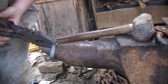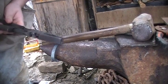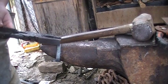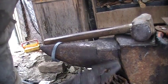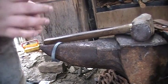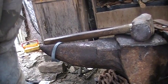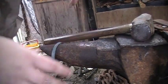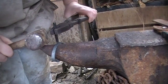I'm going to slide it over the horn to where it'll hang nice and snug, then get the stamp set and stamp it, let her cool off the rest of the way, and then see how she's fitting. If it fits on well we won't do anything; if it needs to be closed a bit more or opened, just a little tweaking. Alright, here we go — about to stamp the '10' in here, starting with the 1.